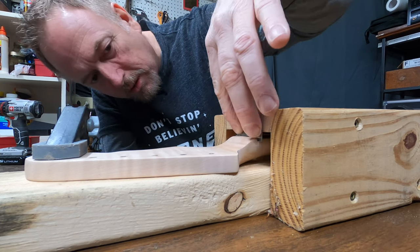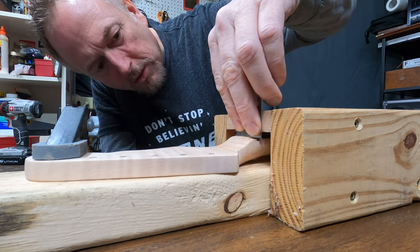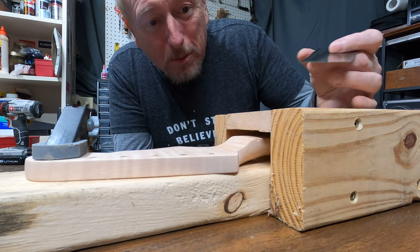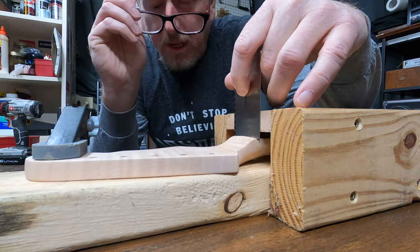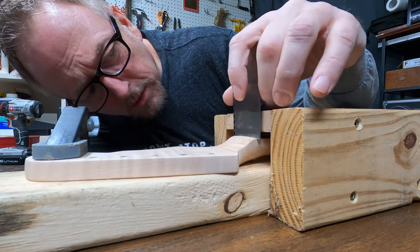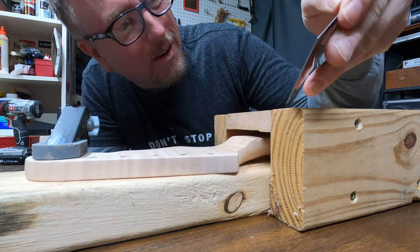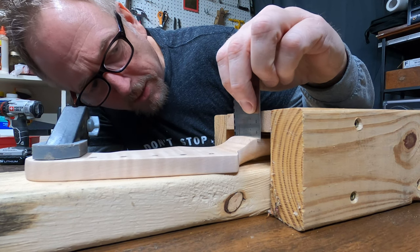Seems to just route perfectly there, so my route should be just fine with that. Now we need to set the depth of the bit. The depth here is 3 millimeters exactly, is where it's at right now. 3 millimeters. Am I looking at the right side? No, I'm not. I was like, something looks wrong there. So here we are. We're at 3 millimeters depth here.